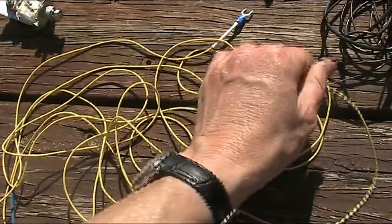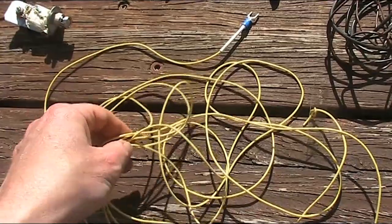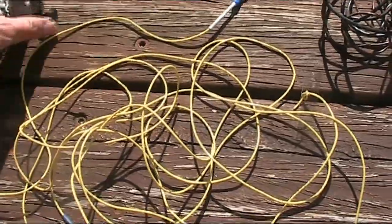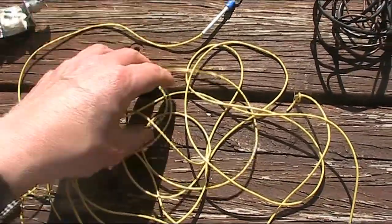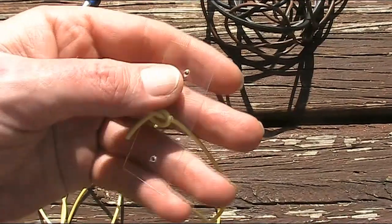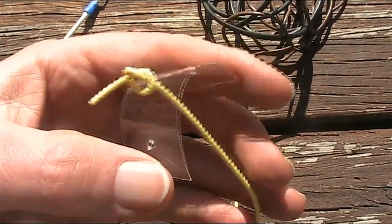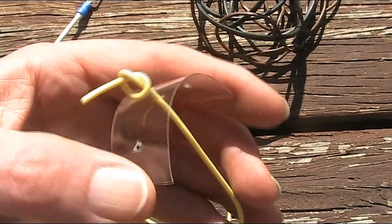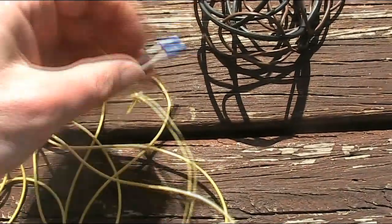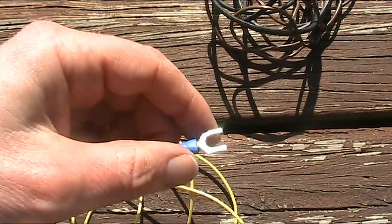Now, the same length as with the Wadetenna, except there's no loading coil in the middle. That coil was only used for 7 megahertz, and I didn't need to cover 7 megahertz with this version, so I've left it out. It's a bit hard to see because it's clear plastic, but there's a flexible bit of plastic that goes over the top, the thin bit of the telescopic rod that holds it up. And right here is the lug that connects into the antenna coupler.